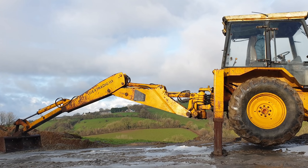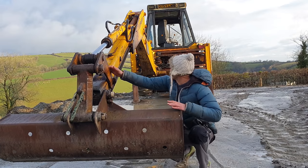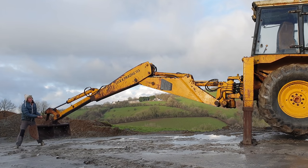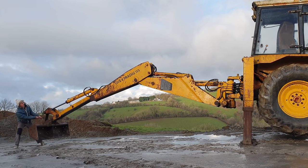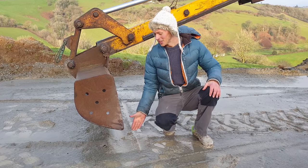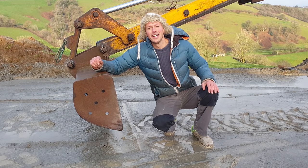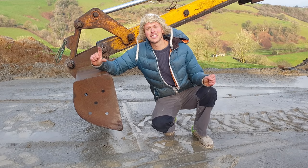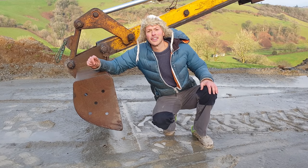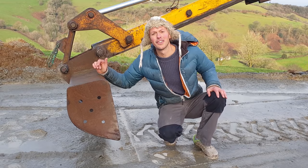With the back actor extended out all the way, you can get a good sense of how much play there is in the various joints just by doing this sort of thing. As a bonus, with it fully extended, you can see if that space diminishes with the engine off just sitting there. And if it does, that's a good indication there are some leaks in either the spool blocks or some of the cylinders. None of that on its own is a showstopper, but it's definitely nice to know about.